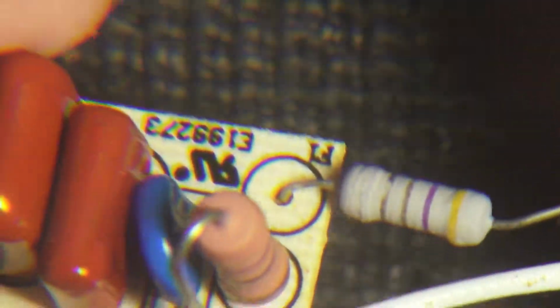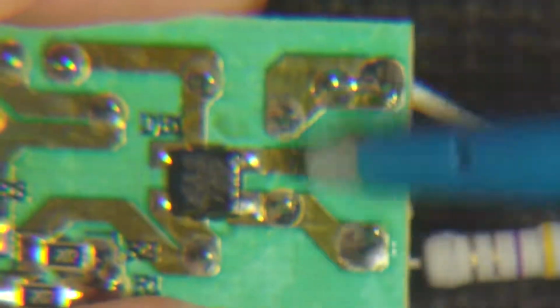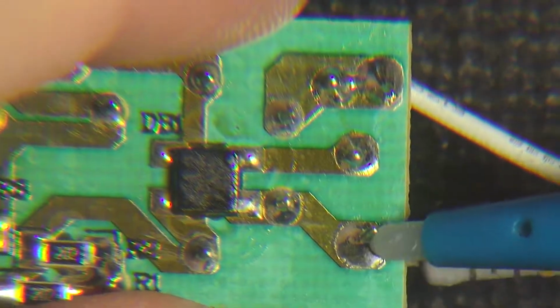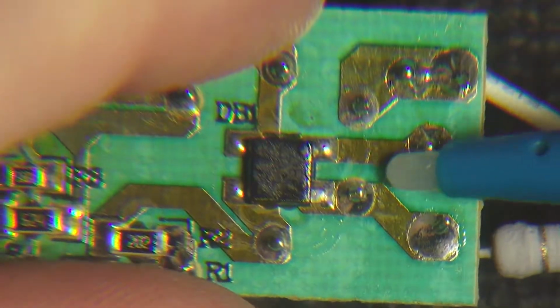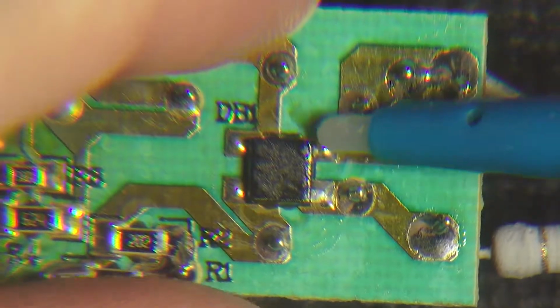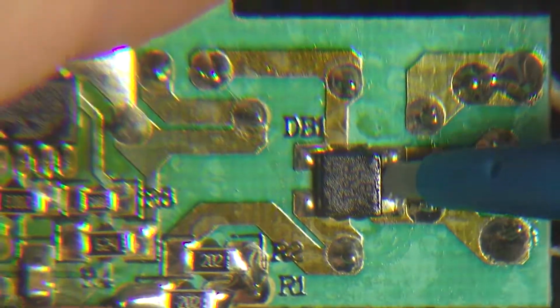That's your fuse. Little input resistor. So is this one across the... Yeah. So we've got the filter cap directly across the input, the live and neutral, and then this resistor limits the inrush to the neutral into the bridge rectifier, as well as the fuse that comes in from the live that goes directly into the bridge rectifier.